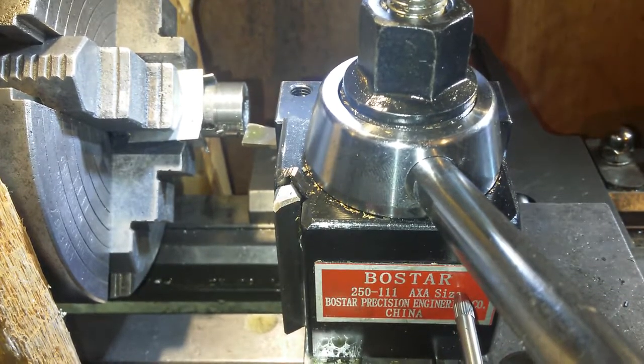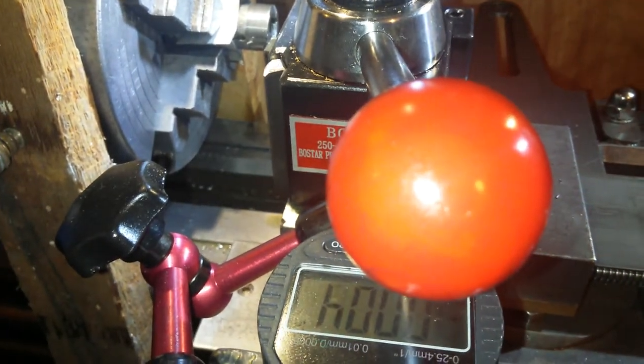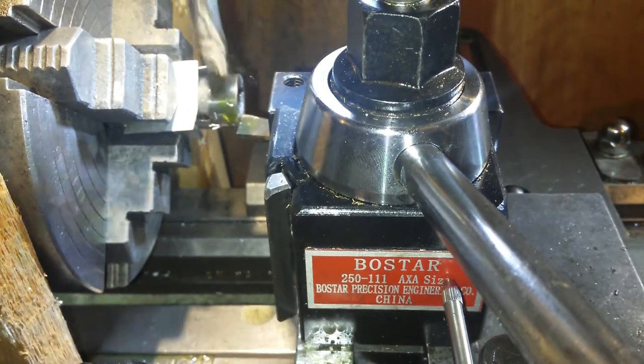So I just realised I've moved off from the cast iron. We're onto steel now. I'm just putting the key in some steel and I am 4/1000ths into my cut. I thought I'd better get a bit of a recording of this. Get a bit of oil.